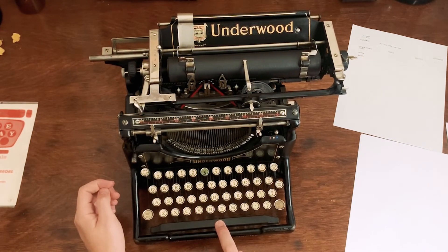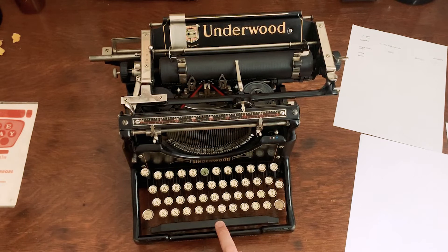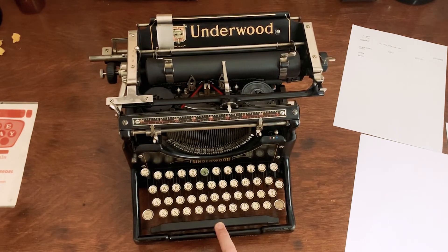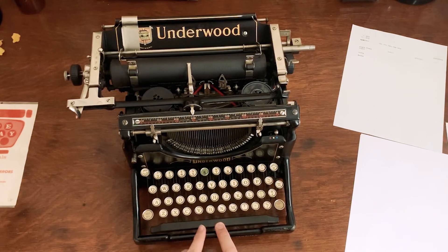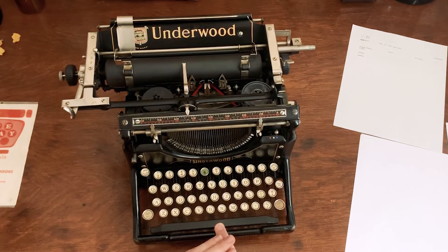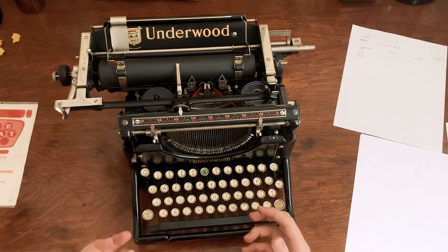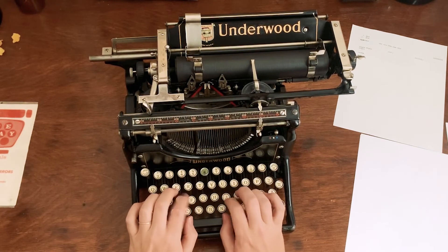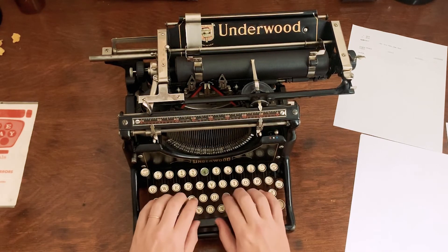This typewriter has an interesting ergonomic feature — it puts more force into your fingers when you type than you put into the key in the first place, using the force of the mainspring that you wind with each carriage return. The spacebar pushes back up harder than you pushed it down, so it can loop on its own and kind of bounces your fingers back up to their starting position with each key. I think that would be an amazing thing if computer keyboards had that.